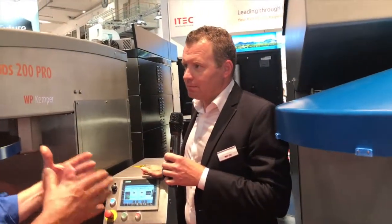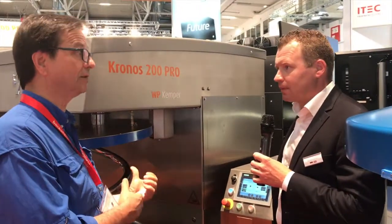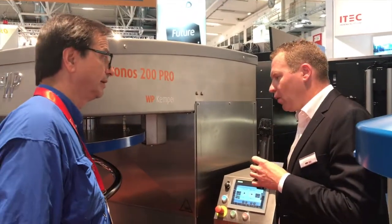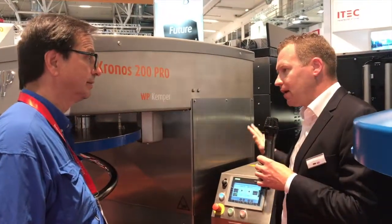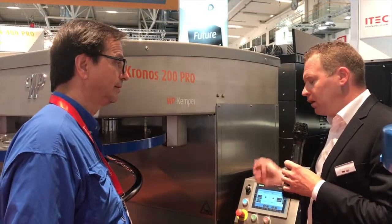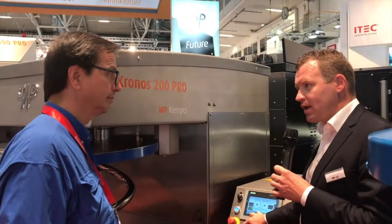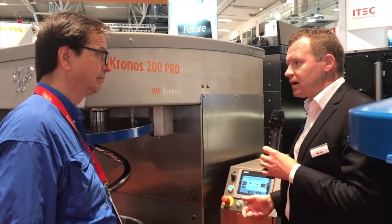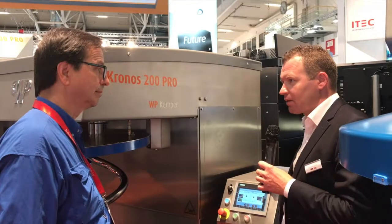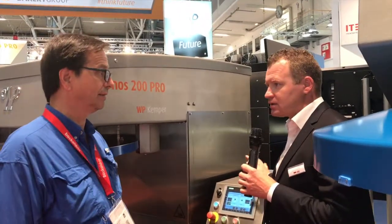Okay, so it'll stop mixing and say you've got to do something, right? Yes, to the baker, you've got to add an ingredient. Yep. When you would like to add ingredients, the mixer stops automatically. The head goes up. You add the additives to the dough. You press 1 and the mix starts again, but the operator does not have to set the timing. It will end automatically when the timing is ready.